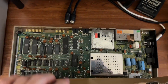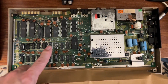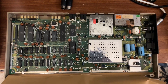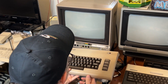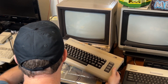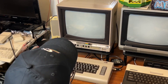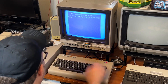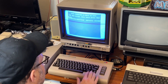I'm going to take this keyboard off and grab another one to see if it's just this keyboard or something with the chips. Let's look in here at the PCB — here's where the reset mod is going in. Some of the memories are socketed and look like they've been replaced. I grabbed another keyboard off another Commodore — the one I picked up the other day that had bad memory. I'm attaching it to see if it's just the keyboard that's messed up. It's definitely just the keyboard on that Commodore 64 that's messed up because this keyboard is working perfectly.